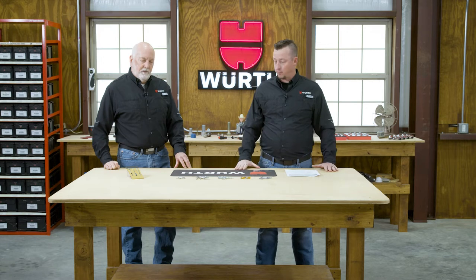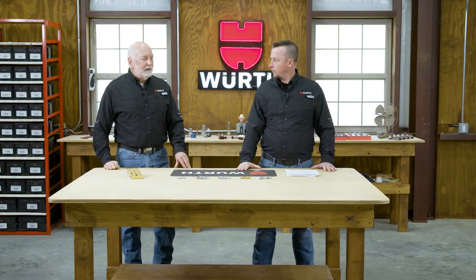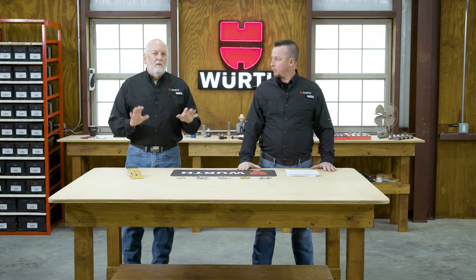One I can think of is solid rivets. Oh, yeah. And that takes actually working from both sides of a workpiece. Yep. Can't just do one side. Old technology's been out there for a long time. Also, we call it an old bucking rivet. Yeah. Hot riveting is another term we've seen used before. Out there for a long time. Long time. We also have semi-tubular rivets, where again, you're working from both sides of the assembly in order to compress the rivet. Those are not what we're gonna talk about.